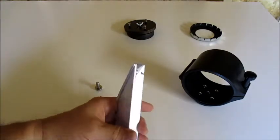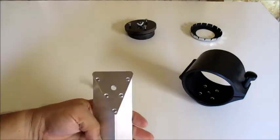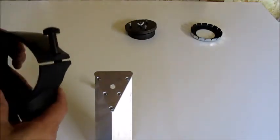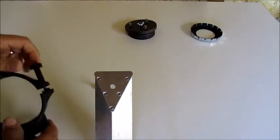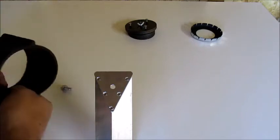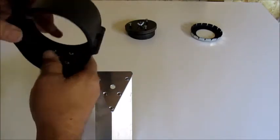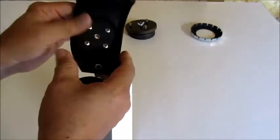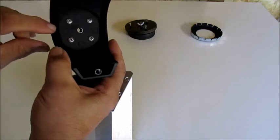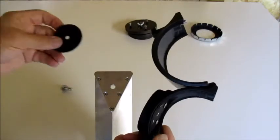This is my plate bolted on here. I've got five 4-40 screws holding it on, and I also drilled a hole in the center which will bolt onto my clamshell holder with a 5/16 screw. On the bottom, I put a block of hardwood maple and screwed it in on the inside with stainless screws. Then I drilled and tapped through it so that the bolt actually comes through into the metal. I got a piece of rubber that goes in between here — it kind of snugs it down and keeps it from moving.